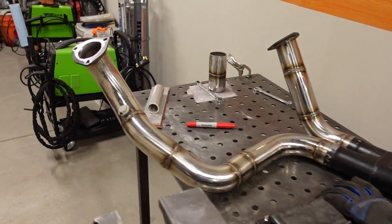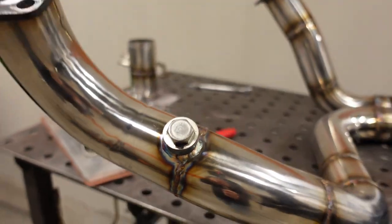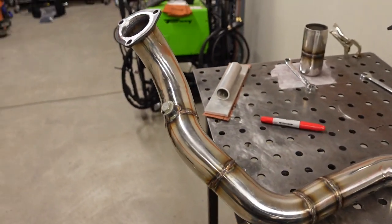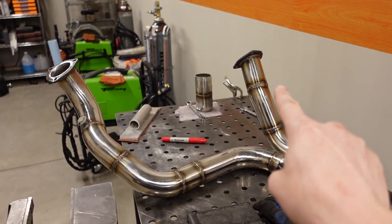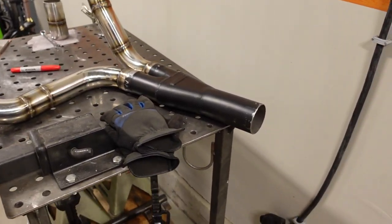suspension kit. I did install one stainless steel O2 bung on the driver's side pipe. The reason I didn't install two is mainly because the Holley computer only uses one wide band oxygen sensor, I'm pretty sure. But if this were a stock GM computer, I'd just have to add a second O2 sensor on there. That way you have bank one and bank two both reading independently before the Y-pipe.